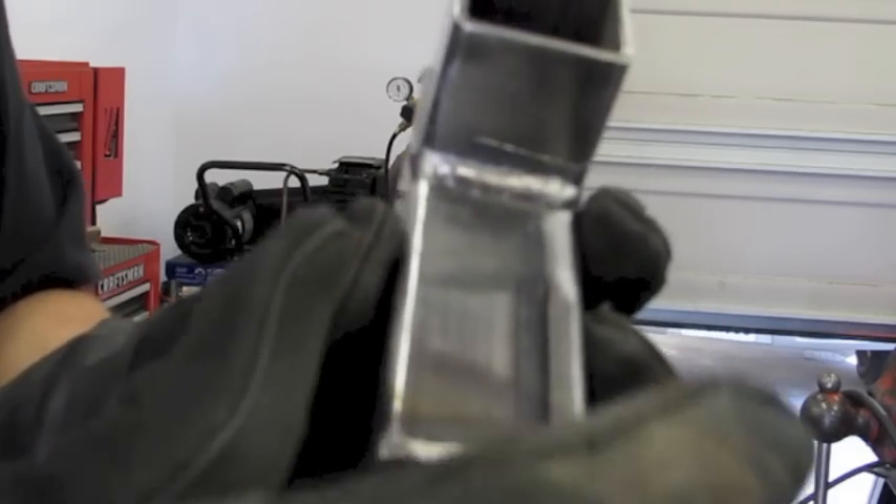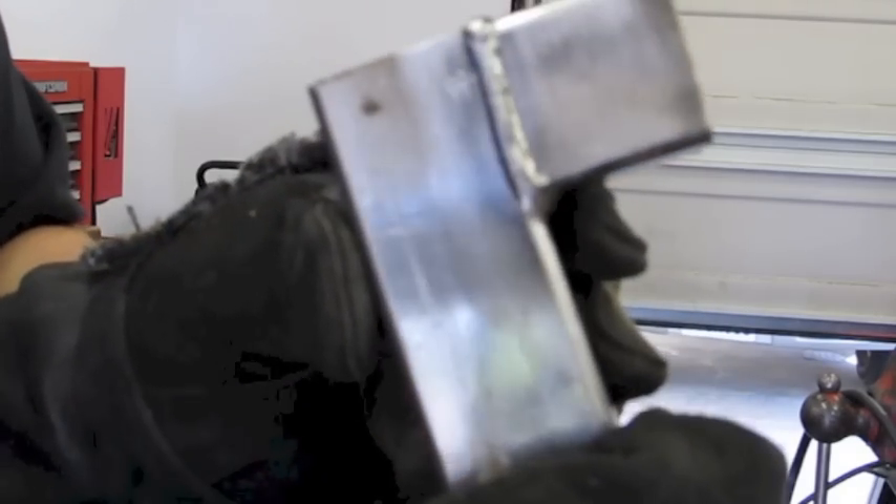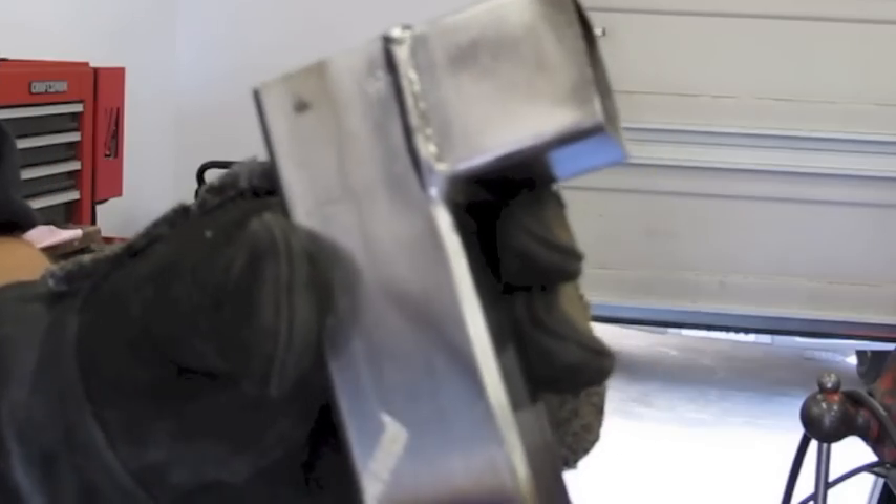Here is the finished product. Starting with the flare bevel welds and the butt weld, the other flare bevel, and there is the fillet weld on the back. I went ahead and ran this through with a little bit of wire wheel so it looks nice and shiny and clean. This is a good result because if you want to grind it down smooth and flush for a decorative item, you don't have much weld to grind down. And if it's not going to be decorative — functional, a tool, something that doesn't matter — the weld is presentable and can be left just as it is. So I'm happy with it.